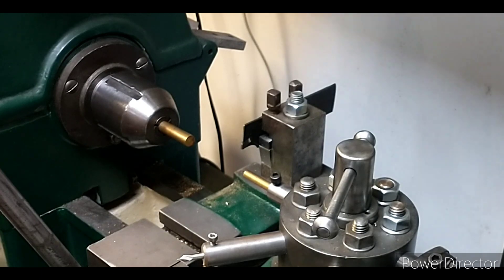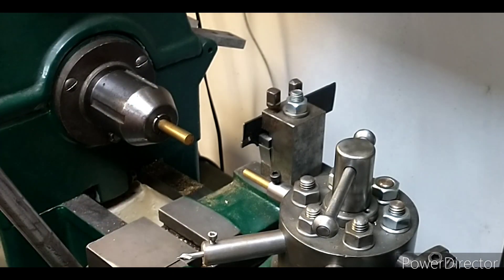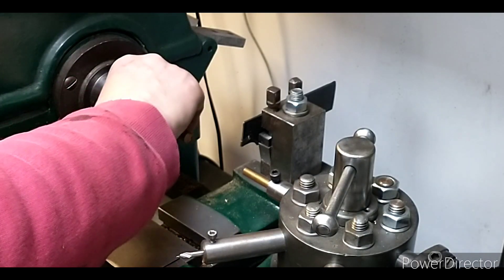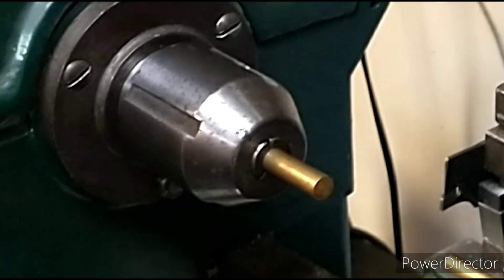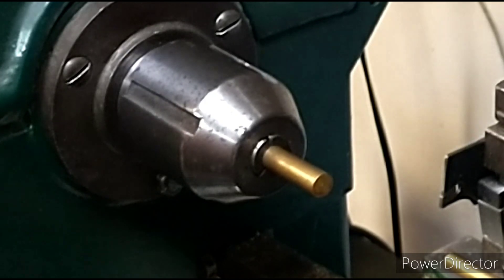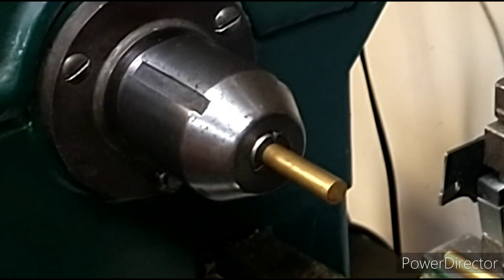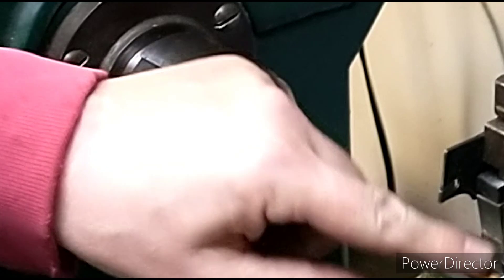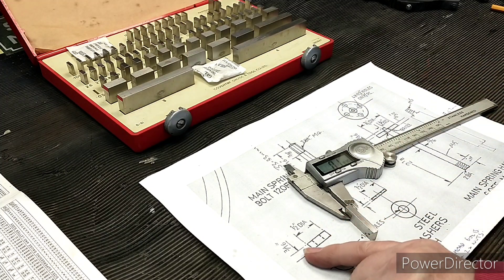At the moment the collet is released. I basically pull it up hand tight and that's almost fully engaged — I might need to just slacken that off a little bit so we've got some movement. That feels pretty good now, so that's the collet adjusted. You can actually see the collet being pushed forwards into this nose — there's a taper there, so that's quite good because it's pushing everything towards the end stop.